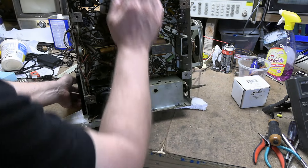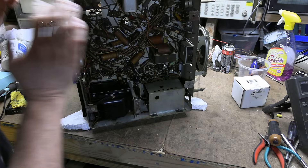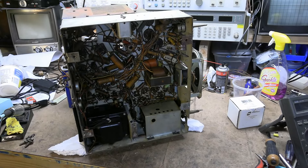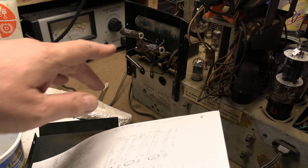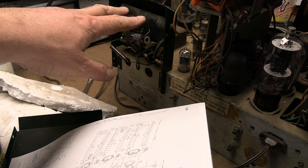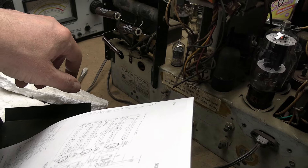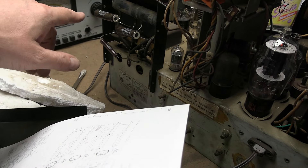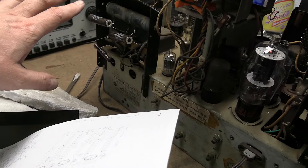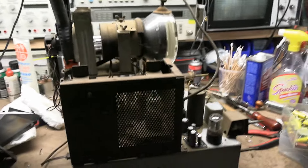Fantastic — it is all original. This is a relatively lightweight small chassis. I temporarily disconnected some wires to isolate the sections. These two are definitely open, and that larger section down there is open too. These two sections seem to be okay. So what I did is I just tacked power resistors in parallel with the open sections — used two 1K resistors I had on hand. It should be 620, 1100, and 125 ohms, but it's better than a dead open. I did have the exact 8200 ohm value for that one. The set is on and they're getting a little toasty.